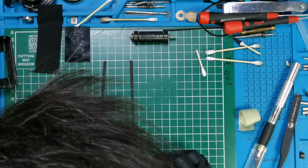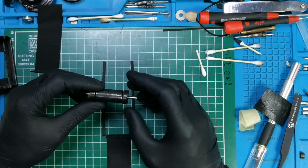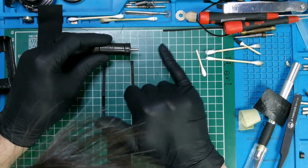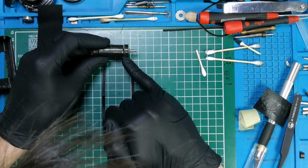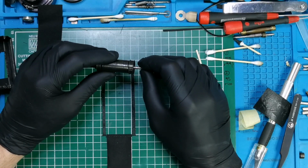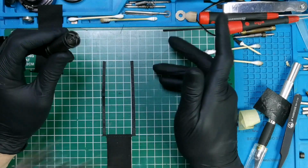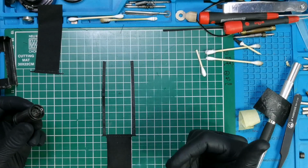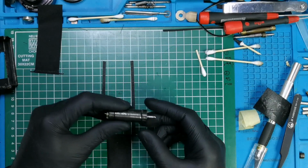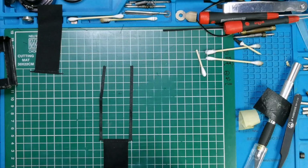Alright, and now you need to glue them to these two rollers. And this is the first of the tricky parts, when you will need to exactly glue the ribbons to the marks. Now just to make sure that I've got everything correctly set up, I usually use double-side tape. Then I get everything back together inside the shutter, test the shutter and adjust if necessary. But since I feel both lazy and lucky, I will glue it. I'll glue it correctly from the first try, hopefully.